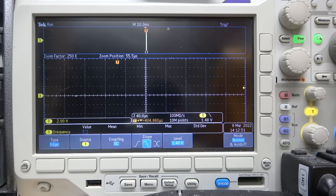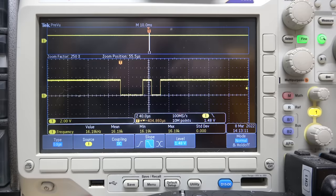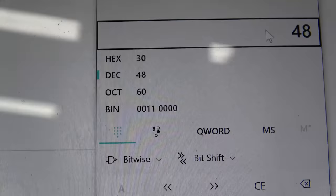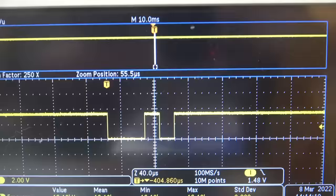And actually, I'm going to do 0. Okay. I wonder if that's an... I bet that's an ASCII representation. I wouldn't be surprised. Although we don't have framing, so it's hard to... All right, see how you got mostly low, some high, mostly low. Look at 48, which is ASCII for 0. In binary, it looks like an inverse of that. See what I'm getting at? So this would be an LSB, least significant bit, first ASCII representation of the character being transmitted between microprocessors.